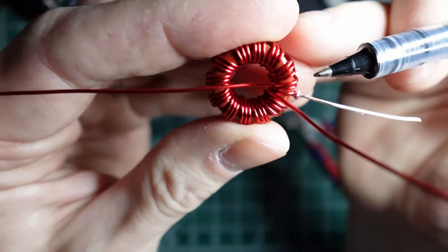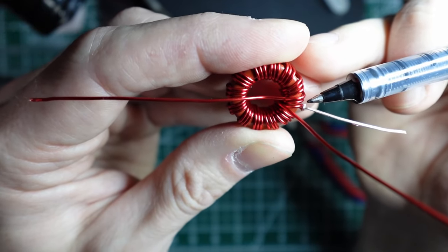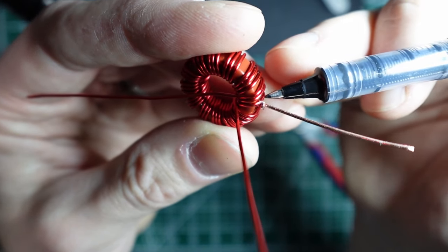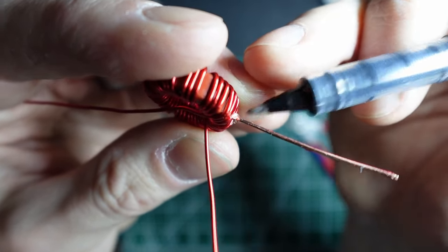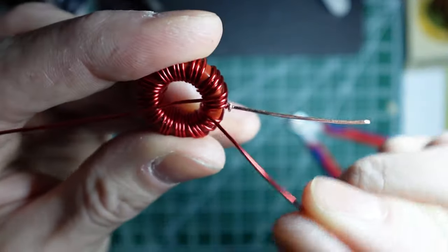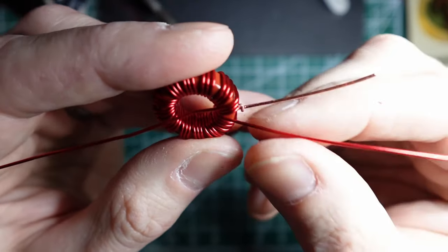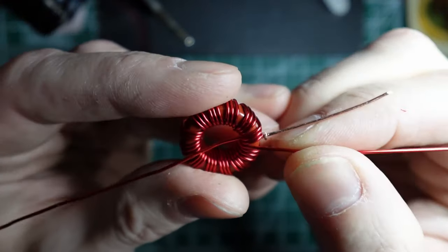And so now, again, what we've got is the starting 3-inch tail I folded over, and that's going to be your radiating connector. And then the end of the first pass is flat against it, and the end of the second pass was long, and we're joining them together with a tail. And this is going to go into the center of our BNC connector. And then our end and final tail coming off is going to be our ground on the BNC connector, or any RF connector. In this case, we're doing BNC.